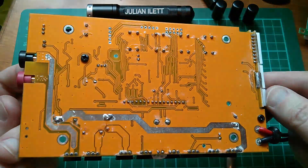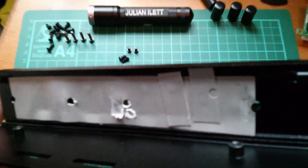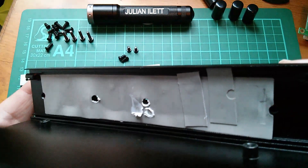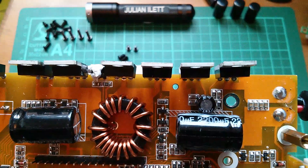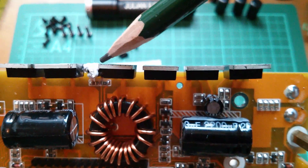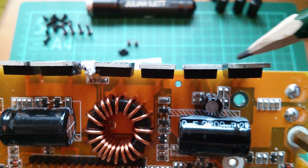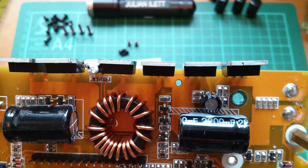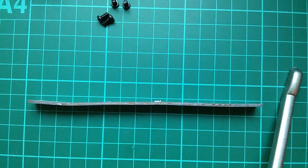Nothing at all on the back — the PCB looks perfectly good quality, but there's nothing actually printed on it. And this, with its extra bits of heat-transmissive rubber just stuck in there, is bodgery at its finest — absolutely appalling. You can see this bow shape in the four components; they follow an arc, not a flat straight line, so they're not pushing flat against the extrusion at the back. That's because the metal bar across the front was bent and bowed. I'm going to have to hammer that flat — put it on a piece of wood and whack it a few times.